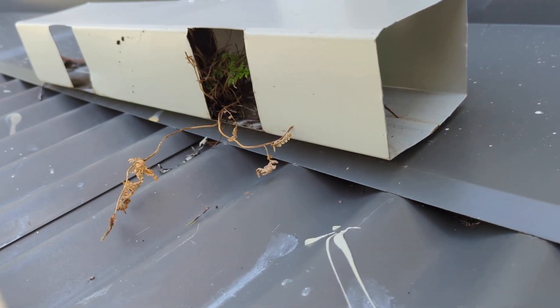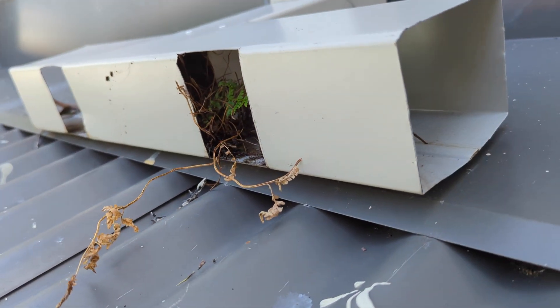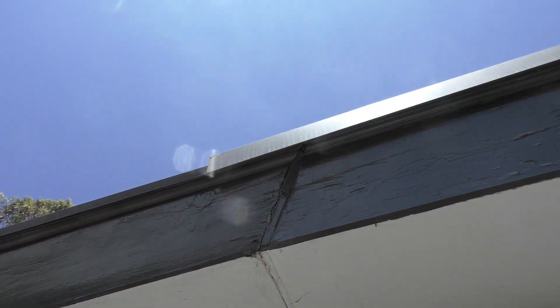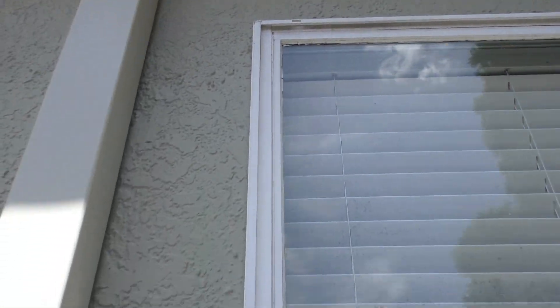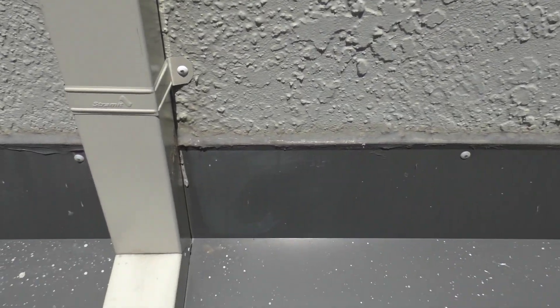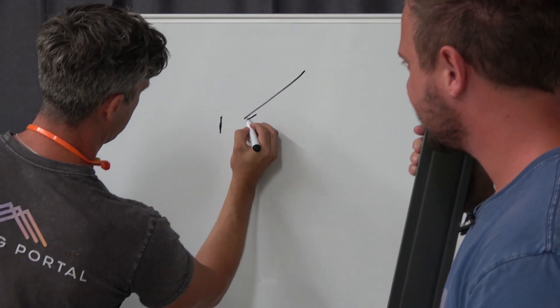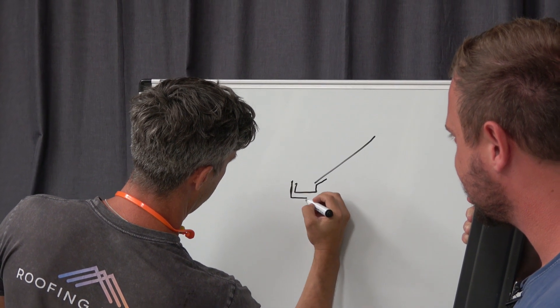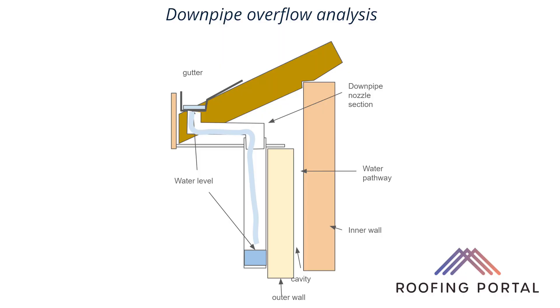Jack found that the top gutter - it's not like a box gutter where you have two roofs meeting, it's more like the end of the roof. You've got a roof coming down like this, then you've got your fascia here, your box gutter coming in like this and up, then your eave here, and then a downpipe coming through. Jack's diagram is showing this right now.